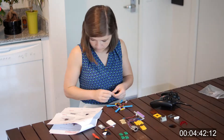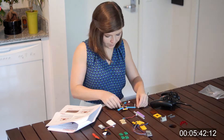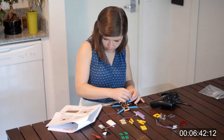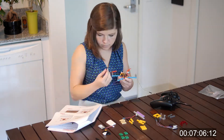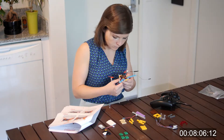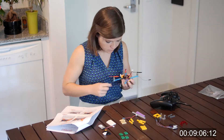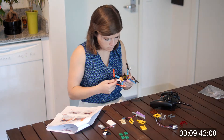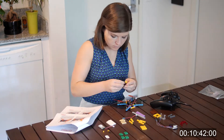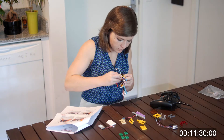The nice thing about this drone is that when you buy it, the control board comes pre-programmed and the receiver is already bound, so you can fly it pretty much within the 15 minutes it takes to set the drone up. It's important that you put the correct motor in the correct place. Some motors spin counterclockwise while others spin clockwise, which is essential to generate lift. You also have to make sure you put the correct propellers on the correct motor. The motors need to spin the correct way in order to push the air in the right direction and generate that lift. You also have to pay attention to detail and make sure you connect the right motors to the right spot on the board, otherwise your drone won't turn on.